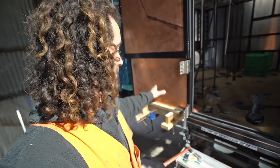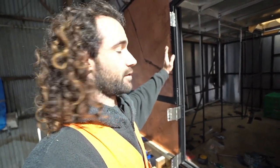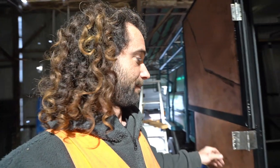Today I'm trying to rebuild these hinges. I've set up a clamp situation where I can sit the door and try to work out the right offset for the hinges. The thing is, if you try to extend the hinges a little bit to make them align, it affects the closing point of the door and that affects where it seals. So you've got to add a little bit to this side and take a little bit off the other side, and have it just in the right spot — otherwise the bottom won't seal or the top won't seal. It's a real tricky one. I wasn't intending to make a video on this because I just didn't think I had the energy to do both, but it's such a pickle that I thought everyone would like to see what's going on.